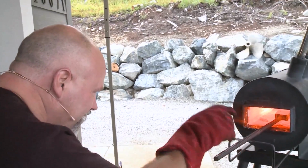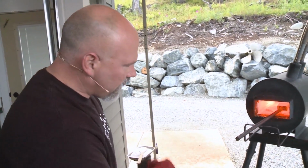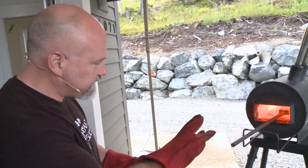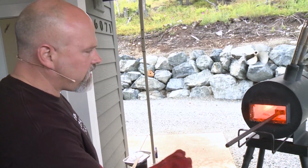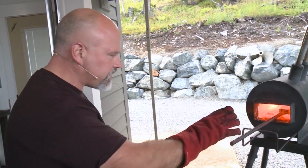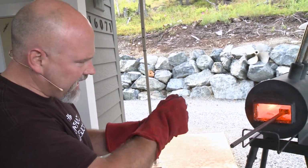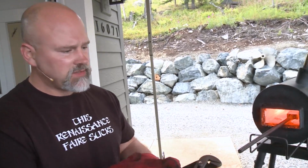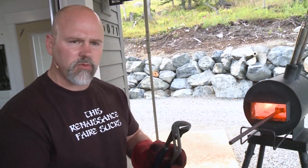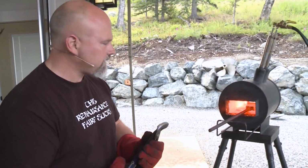Now you might be asking, what if I don't have a welder to weld a piece of rebar onto the handle? What if I don't have a welder so I can tack weld a piece of rebar onto use as a handle? You don't need one, and you don't need to be able to tack together the stack either. You can do it with wire. So just take your stack, and before I had a welder, I used to use heavy coat hangers. So you just cut coat hangers, wrap around and twist the wire together.